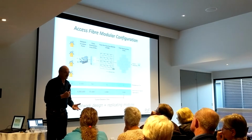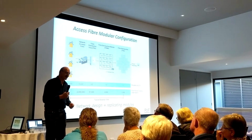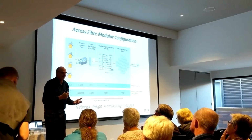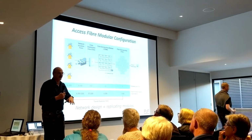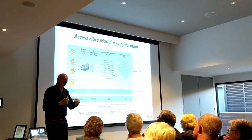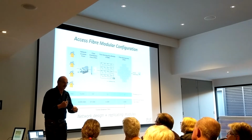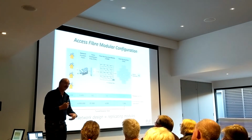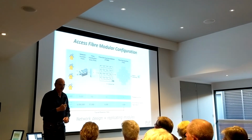The copper, again, it's a very old copper, especially up here in the mountains. We've got some of the oldest copper infrastructure around. And there are many, many reasons for it to drop out. The configuration you have with fibre to the node is less reliable, and then on top of that, you've got a service provider that is providing an IP-derived voice service on top of your broadband connection, and they can have issues as well. So it may be a combination of those things.